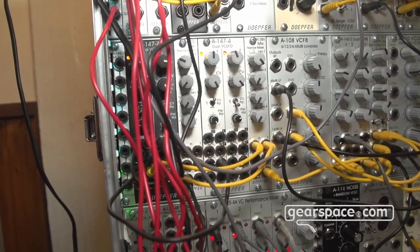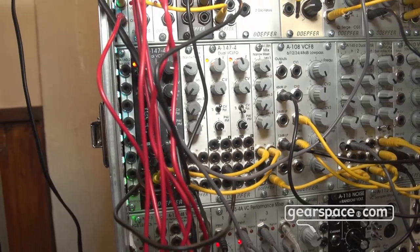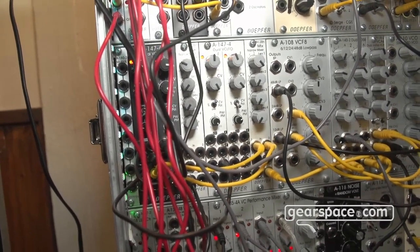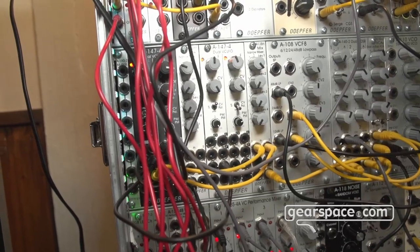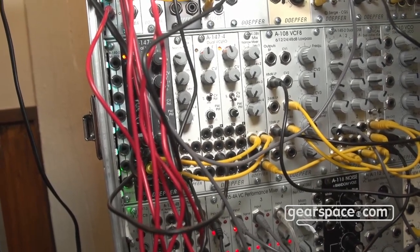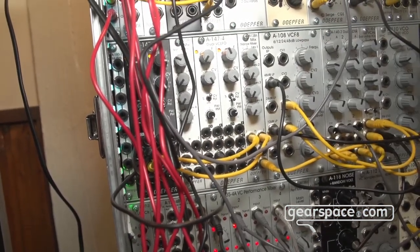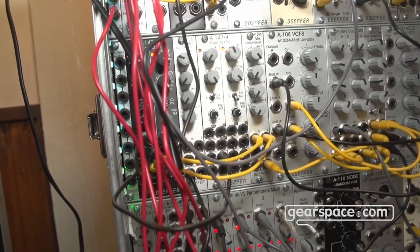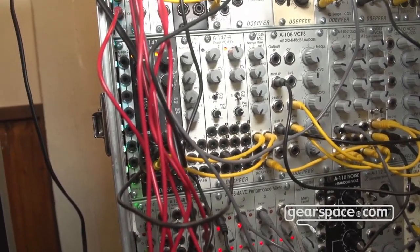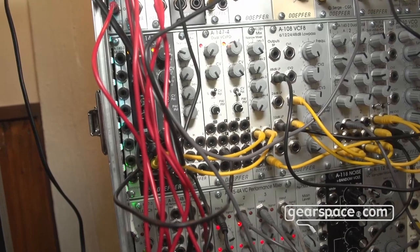The special thing about it, kind of, is that it can be controlled with 1 volt per octave. And depending on the jumper setting, it goes more or less deep into audio range. One setting is a maximum frequency which is limited around 2 kilohertz. The other one is limited around 200 hertz. And the 2 kilohertz one, there the slowest setting is about, we can try and watch the LED while I'm talking. And on the slower one, it's 10 times longer, the cycle. And due to the reset input in audio range, it could also do hard sync.